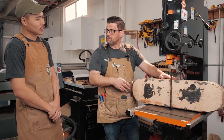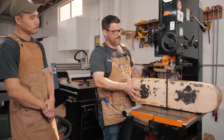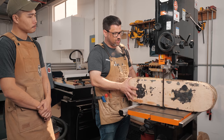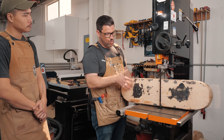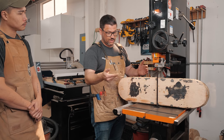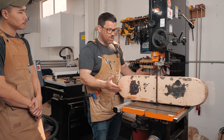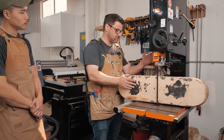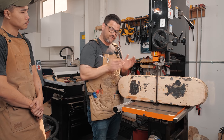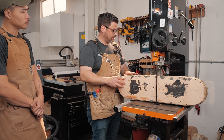Skateboards are usually around eight inches tall. Just like resawing a log of walnut into lumber, we don't have a good reference surface — there's no way to get a straight cut without one. So we're going to create a right-angle jig out of plywood, just like I'd use for a log. We fix the blank into the jig, slide the whole thing against the fence, and we have a flat reference on the fence side and table side to get a straight cut. We're going to head over to the table saw, whip up a quick jig, and come back.